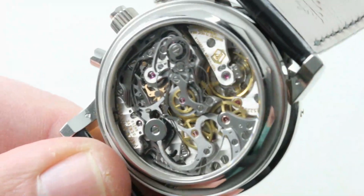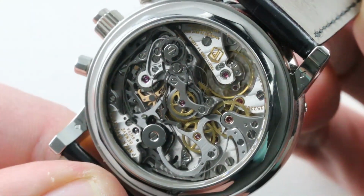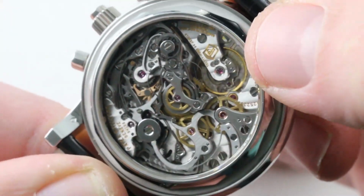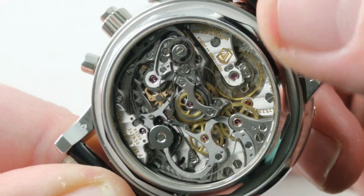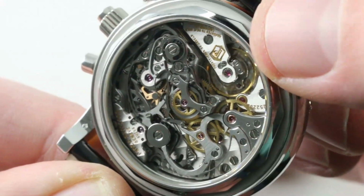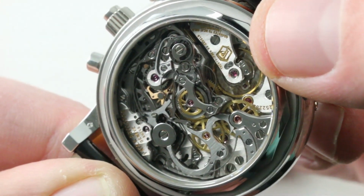Turn it all over. Let's see how we can get everything in focus again. Okay, this is Patek Philippe manufacture caliber 29-535 PS Q. 4 Hz beat rate, overcoil hairspring adjusted in 6 positions, one more than a chronometer. The overcoil helps to keep equal time, good time, isochronic time in each position with respect to gravity. The Gyromax style balance is a Patek Philippe engineering hallmark that is both more shock and vibration resistant and enables the watchmaker to more precisely adjust the mechanism.